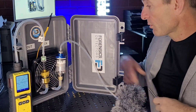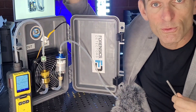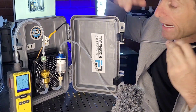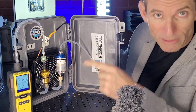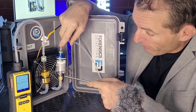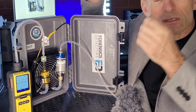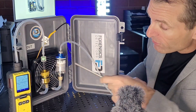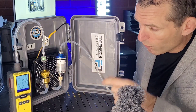A few points: the system comes with a charger — pop it on, it converts 110 volt down to 12 volt DC so the fan can operate and cool efficiently. When the water trap is filling up with water, get yourself a small flathead screwdriver, pop up the little valve, and it will let the water release onto the ground. It's about a 30–40 ml reservoir and it will trap the water.